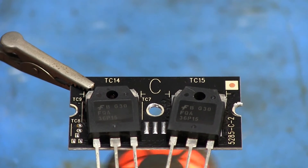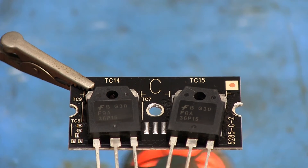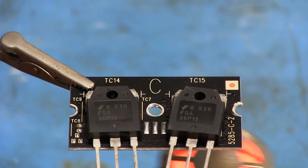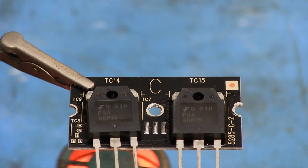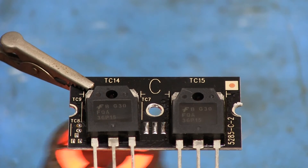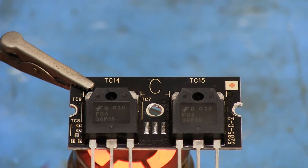I've been heating these for a couple of minutes now and I'm going in from the bottom, gradually bringing in the heat gun. Once I start seeing the flux start to boil that's when I'll go in with the tweezers and give it a nudge, and hopefully see the MOSFETs just float into place. There it goes — you saw that, the one on the right just kind of fell into place. I give it a nudge and there it goes. The one on the left — give it a tap — there it goes, now it's in place.